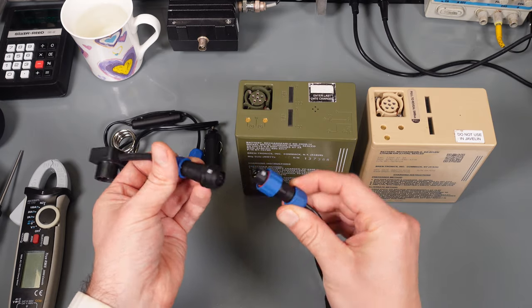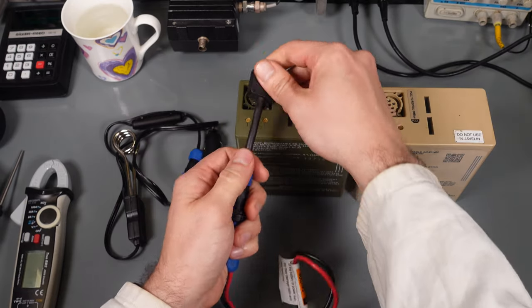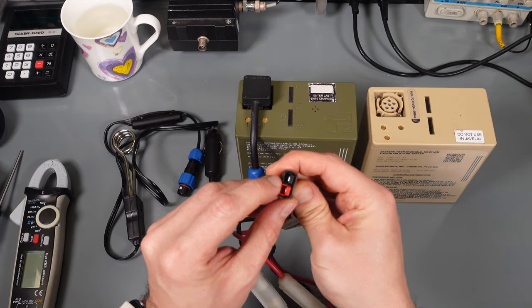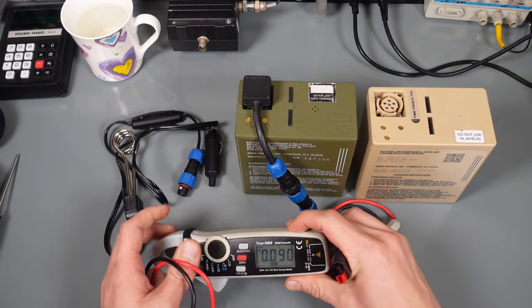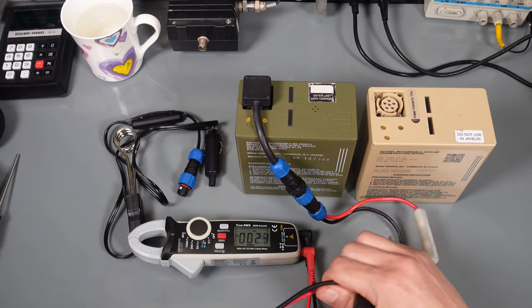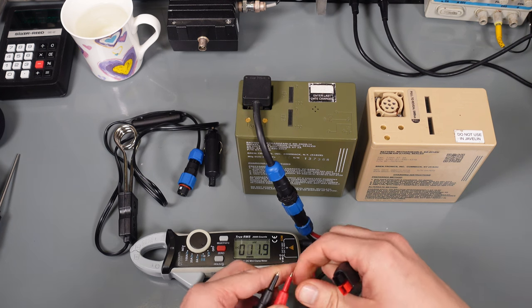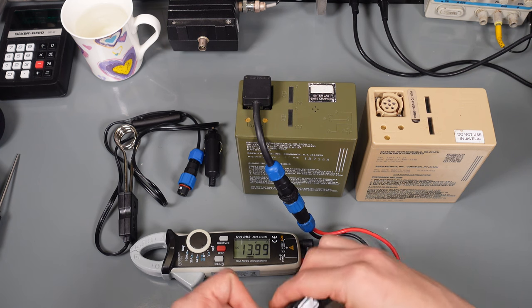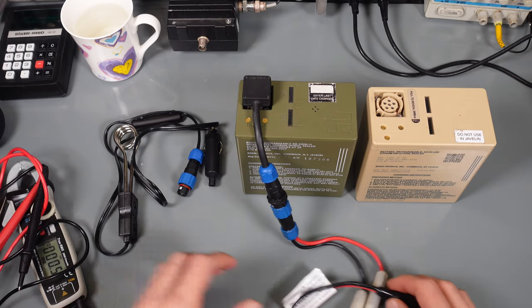So I've got this cable that I can mate like this. I can screw it here, and here, going through the fuse, I've got 12 volts. If we grab the meter, let's go to the DC and let me probe it, and we should get a steady reading. As you can see, 14 volts, it's fresh from the charger, and this is our 12 volt nominal.